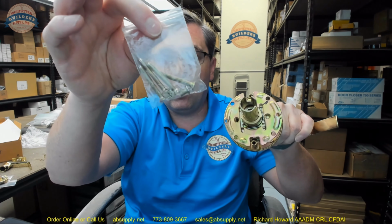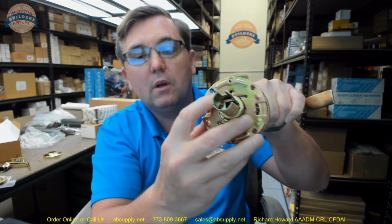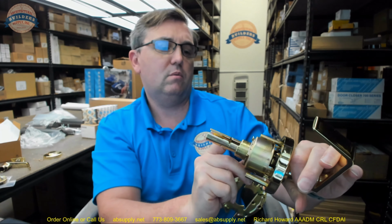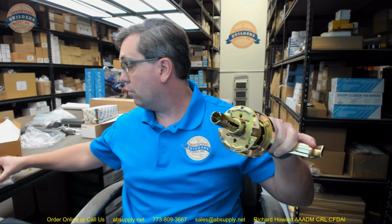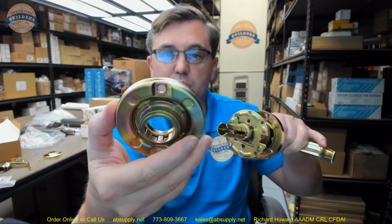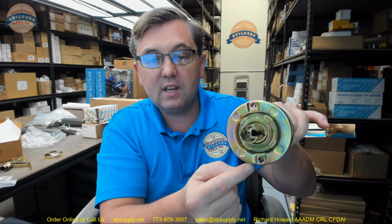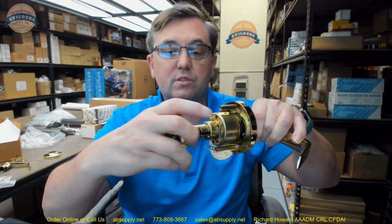Two of the 4 long screws are going to go through this hole, as I said earlier. Sorry, I have that upside down, or backwards. Through this hole into the tapped hole here. Yeah, indeed, tapped hole here and here. That goes on, 2 screws down here. Then your inside rose assembly will come, and that's where your spring cage is. It's buried inside of here. That's what keeps the lever returning horizontal. That will come down. Then here and here, your other 2 long screws will go into your through bolt posts.